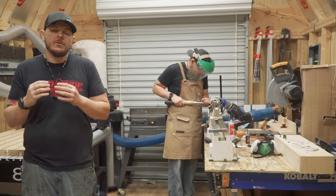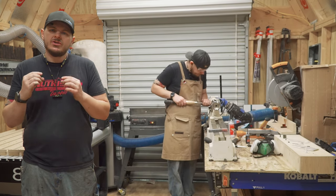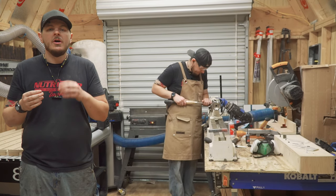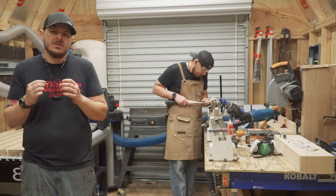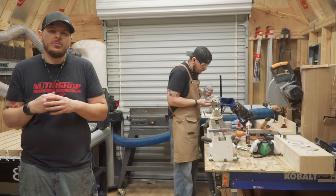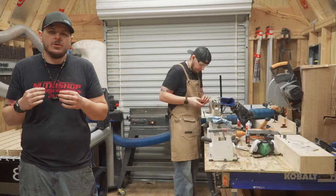This carbide cuts extremely quick through the epoxy. As you get closer to your finished turn size, slow down, use your bushings. That's what they're there for. They're to guide you for the finishing diameter at the ends of the blank or the ends of the tube, so when you press the hardware into place, it fits nice and seamless.